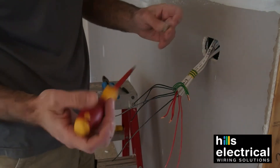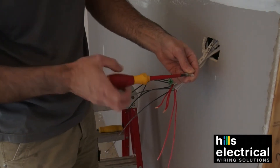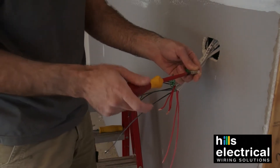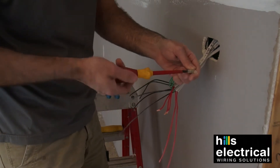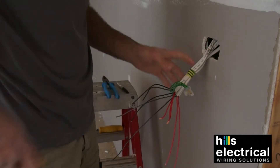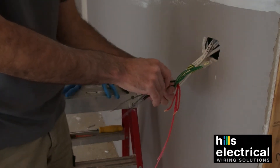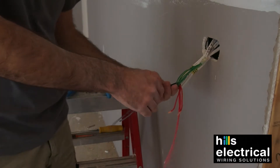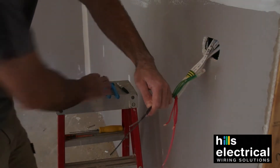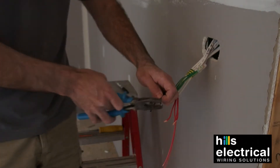Open up the terminals and put the earth connector on. You've got to use a two-screw connector — or a double screw connector — for the earth wires. Bend it back. Now we get our neutrals. This will end up going in the connector because you won't fit five neutrals into a terminal on a switch.